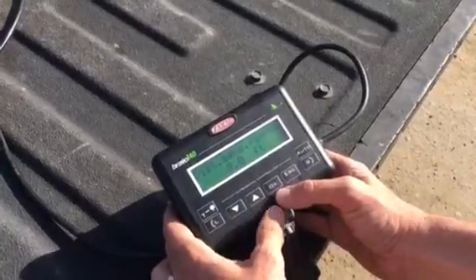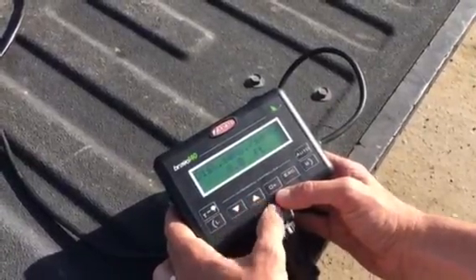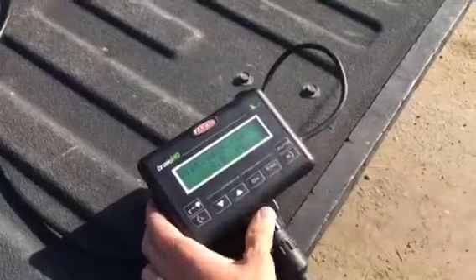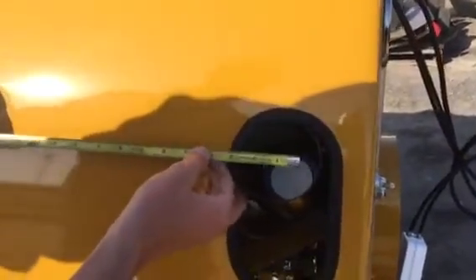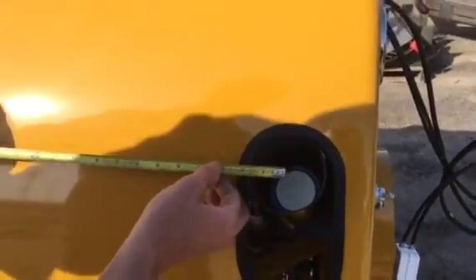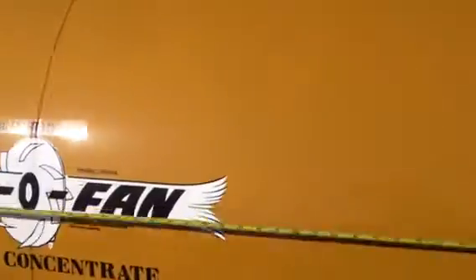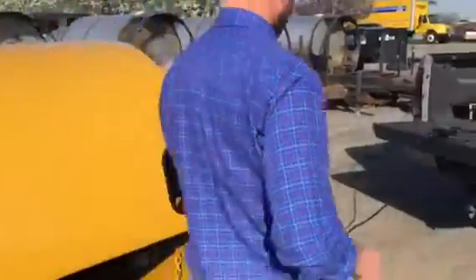The distance sensor is the distance between the center of the sensing eye and the first nozzle. Right now it's calibrated for eight feet. To do this, we come over to the sprayer — in this case the cans are three and three-eighths inches — so I'll hook on this edge and add back about an inch and three-quarters. So we're at nine feet, meaning nine foot two is where you want to set the sensors for calibrating.